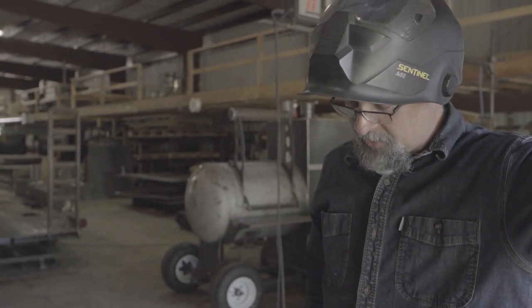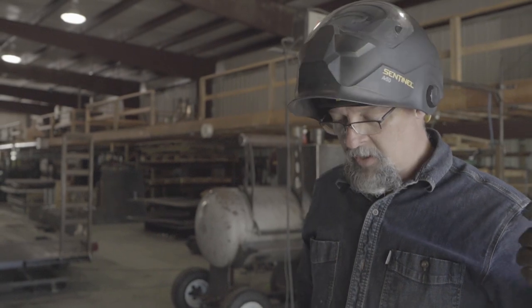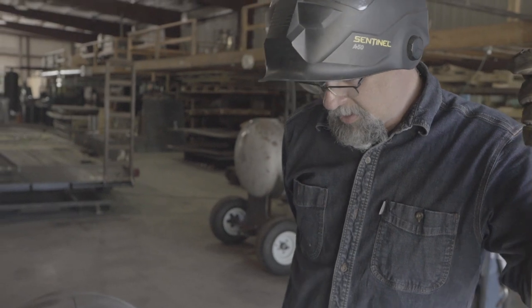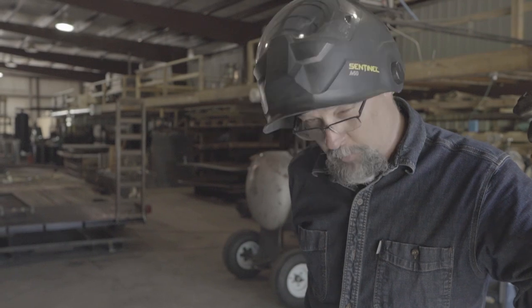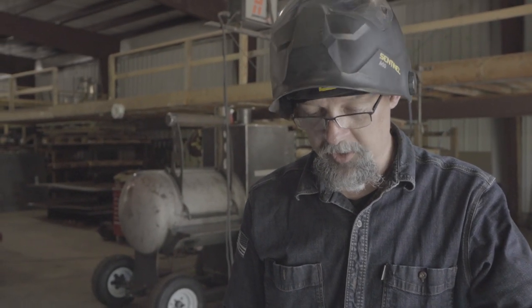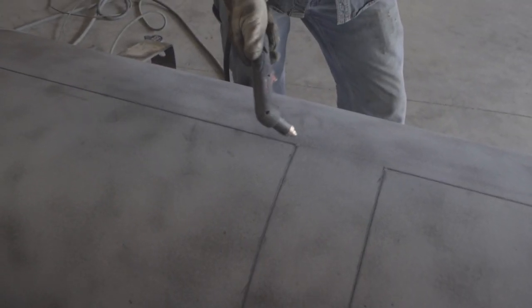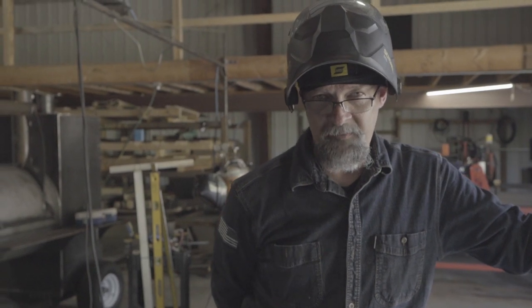I'm actually really impressed because this thing didn't talk to me at all when I was cutting. What I mean by talking to me is you'll hear it cracking and popping and creaking and twisting — that's just relieving pressure from whatever stress was put into this tank when it was welded together. Anyway, it didn't move at all. My personal opinion is that whether you cut with a plasma cutter or a slicer disc, it ain't going to have much to do with whether the doors warp — cutting a little piece out of a big tube, things are going to relax and move. I like to leave the door attached in the corners because I'm going to take a slicer disc and run through there to clean up the gap before I ever get the door out. Then I'll take a hacksaw blade or a sawzall to cut through those corners for a perfect corner, and then just a flat file to clean it up when done.